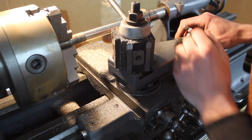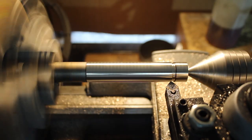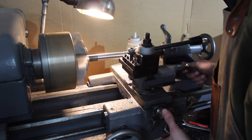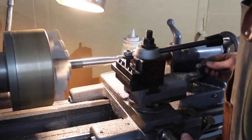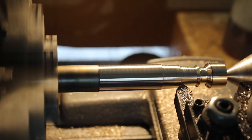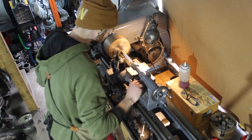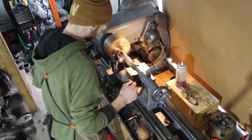I cleaned up the whole piece and then set my compound to just a few degrees because I wanted a bit of a taper on this little cannon. I machined a little recess and then, just using the compound, I went in and out taking a couple thou at a time. After a bit I'm left with a nice little taper. I wanted to detail it to make it look like a classic cannon. I don't really know cannon terminology too well, but I machined in ridges and just went from my head of what I thought a cannon was supposed to look like — I was really just having fun.